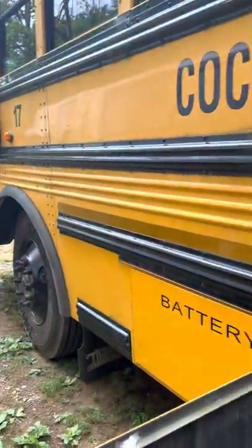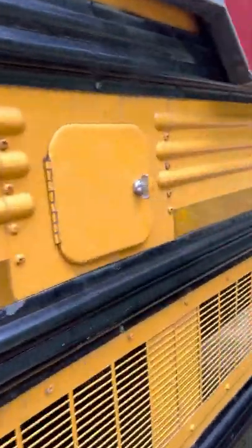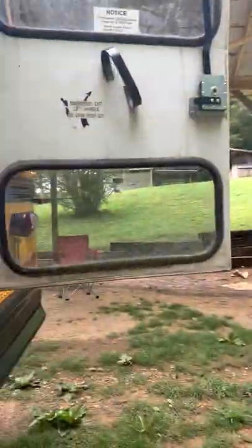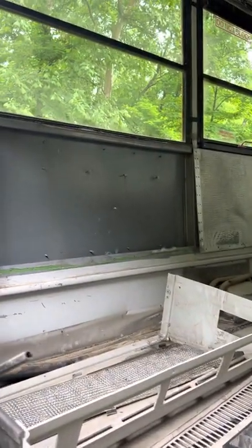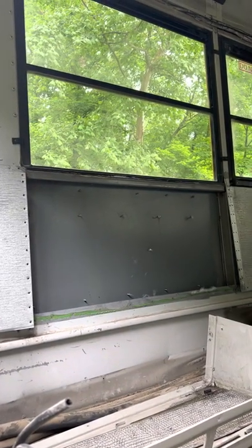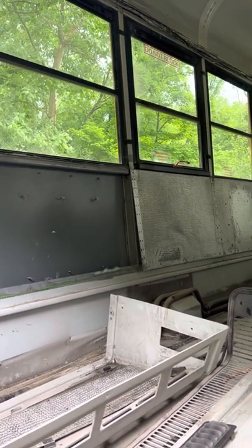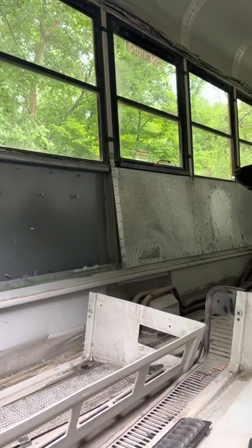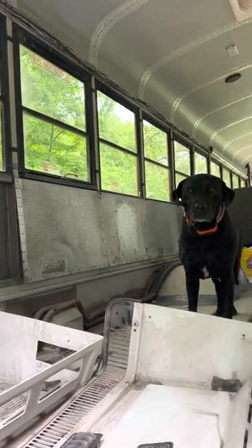While I'm waiting on that, I'm not going to cut any wires. I'll continue taking these wall panels out, which I am cutting. I'm not taking the windows out to get those panels out — that is not something I'm interested in. They're not leaking, they're pretty new windows, they're going to be fine. I'm going to just take a pair of metal-cutting shears on a drill that they sell at roofing stores and cut the rest of these things out.